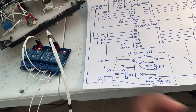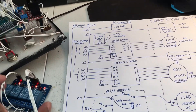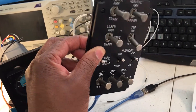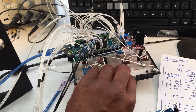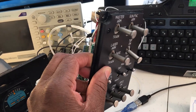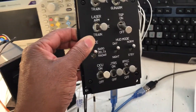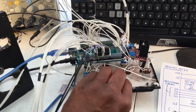We set the direction based on whether the flag is in or out, then energize the relay for about 100 milliseconds to drive the motor. Because in the cockpit the Avionics HUD control panel is next to the standby instrument, I used that panel to wire in the standby ADI. Deadman on the forums was kind enough to sell me some mil-type switches that are actually in the cockpit, so I swapped those out as well. That panel turned out pretty good — thanks to Deadman for the switches.